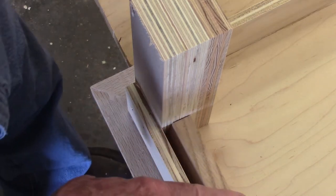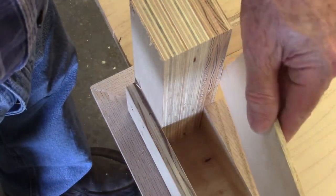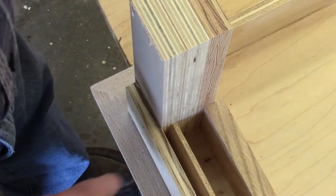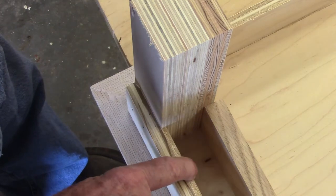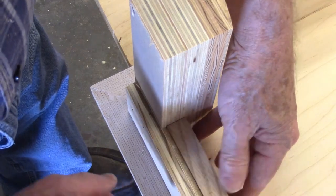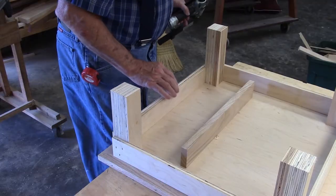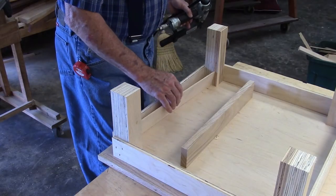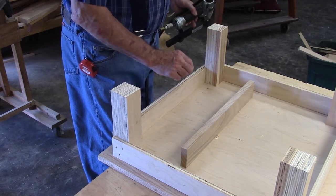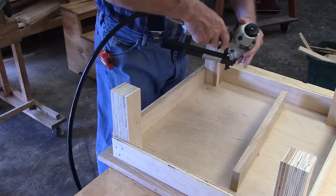Well, you want a little relief there, and so you build into the table jig a little 3/16 inch spacer right there. I think that's more like a quarter. Now you automatically get that little relief right there. Now these spacers are real easy to install. They don't even have to come out all the way to the edge, because all you're looking for is getting that gap. So you can just put the spacer in and tack it in a couple of places.